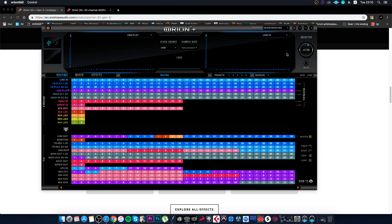The interface has a huge amount of clock source control. You can clock from USB, SPDIF, MADI interface, ADAT, Word Clock, or even from the internal preset — specifying the sample rate so it works at that exact sample rate.